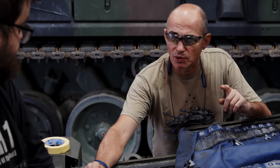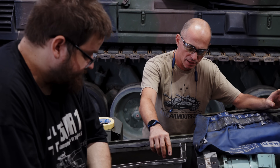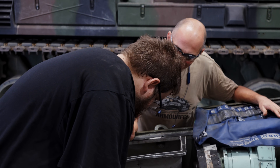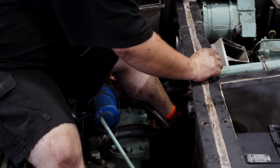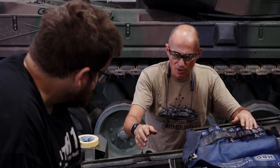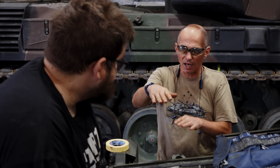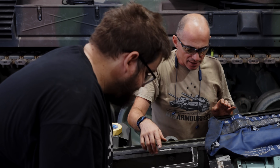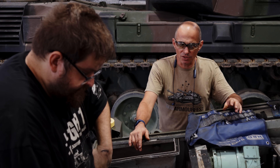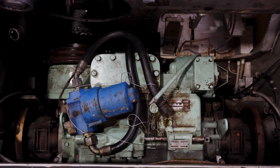How far away are you from actually lifting the transmission? It's pretty certain that with a lot of these POMI systems, the height and alignment of the transmission is set by shims underneath the transmission. So before we actually loosen the bolts off, let's have a look to see if there's a way we can mark the position of it — because there could be alignment side to side, but also the height. I reckon that misalignment could also be a reason why that shaft potentially failed, because the alignment between the engine and the transmission has to be really spot on. Otherwise it will fatigue the shaft. So before we loosen any transmission bolts, let's see if there's a way of marking how it goes in.